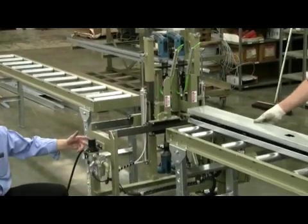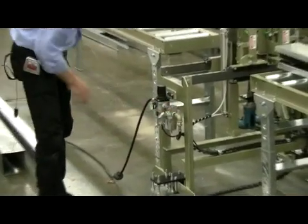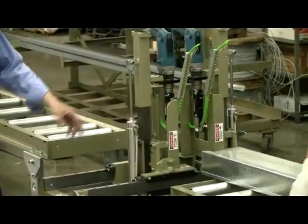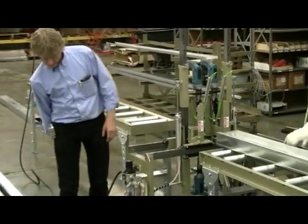We're coming in with about 100 psi. You've got a dump valve, so if ever we shut it off, there's an emergency stop on the operator's side of the controls, on this other side, outside the viewing area. If you hit that, it'll automatically dump and dissipate all the air out of the system.